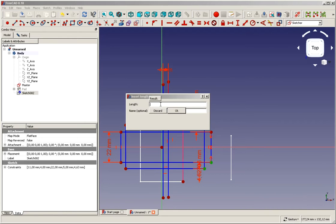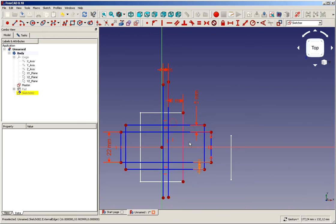Now all we need to do is, because it's a constraint inside this sketch, we start by typing the C. This brings us to constraints, as again we have only one. It's constraints width of metal. It brings us to 5 millimeters in grayish text, and the 5 millimeter constraint is now in orange, which means this is a constraint that is referenced from something else.